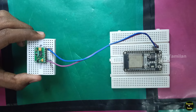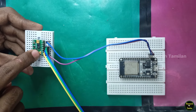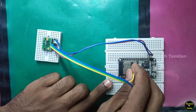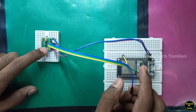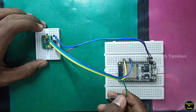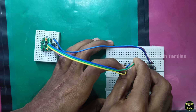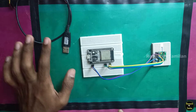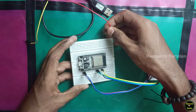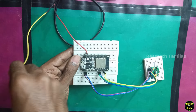On this sensor we have SCL, SDA, and INT pins. For SCL, we will connect to D22. For SDA, we will connect to D21. For the INT pin, we will connect to D19. We will have the wiring diagram link in the description. If we have the ESP32 board, we will use a USB cable, which provides 5V output to VIN.